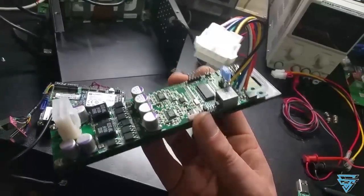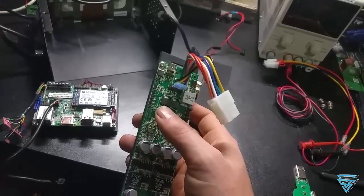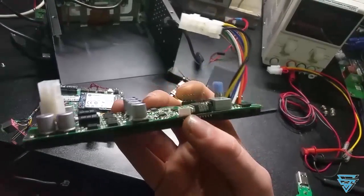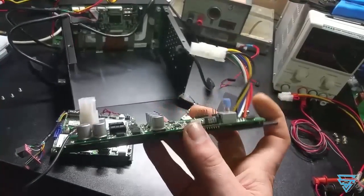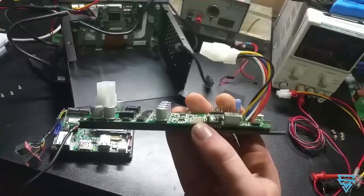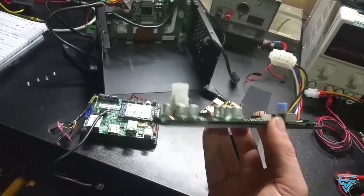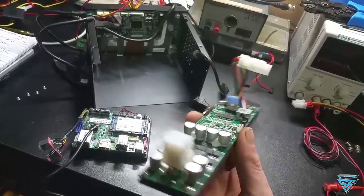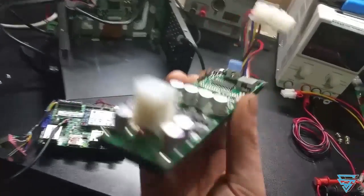It has the ability to run scripts for shut on and shut off. You can actually control other peripherals through external relays by running scripts based on certain criteria. I didn't use any of those, but I may in the future for the cooling fan. You set the voltage you want it to maintain no matter what the voltage in is, and you can also set whether it acts as an automotive power supply or a PC power supply. In an automotive state, it will actually send the power on and off signals to the motherboard, and all that wonderful stuff.